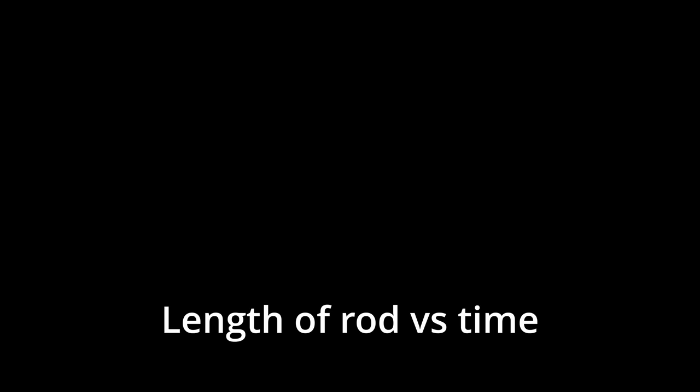Not much use so far, but imagine for a moment that you could stretch and compress the rod so the resonant frequency can be moved up and down a little. As you change the length of the rod, the amount of energy it harvests from the radio wave changes, as does the resulting re-radiation. If you could change the length of the rod thousands of times a second, you could use it to apply audio modulation to the re-transmitted signal. There's a problem with a simple straight rod, though — it's not sharply resonant. Unlike a wine glass, it resonates poorly over several percent of its central peak. Part of that's because it re-radiates the energy it receives very effectively, assuming there are no other losses. In reality, all practical materials do have a bit of loss, but it's negligible for a copper or silver rod in free space.